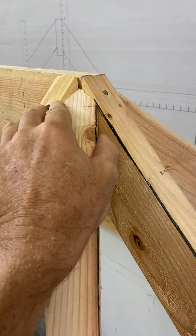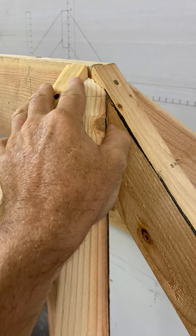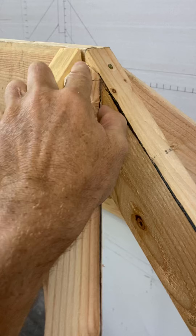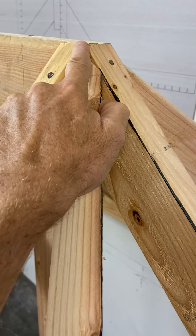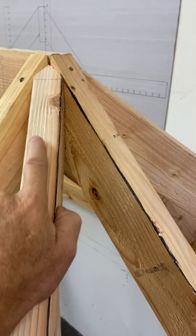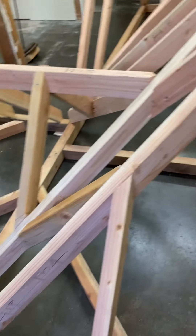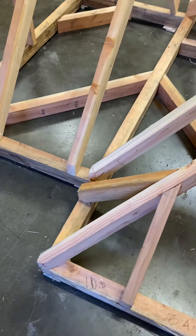Now you can see where the backing angle would be — it would be a point on the top of the hip, in which case the sides would line up and the center would line up, but that would mean that you would have to use the center line of the hip for the heel stand at the bottom.